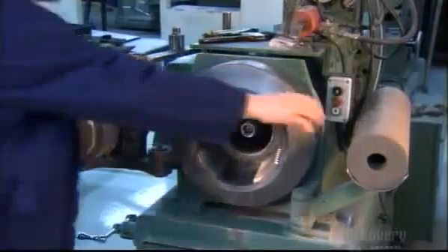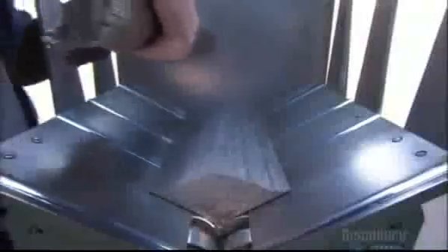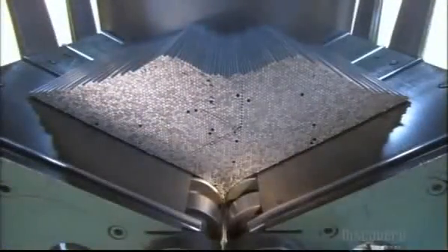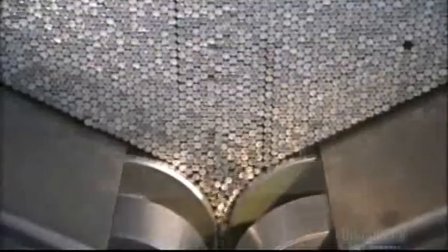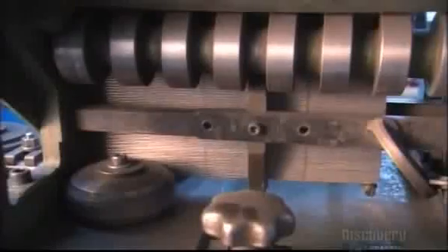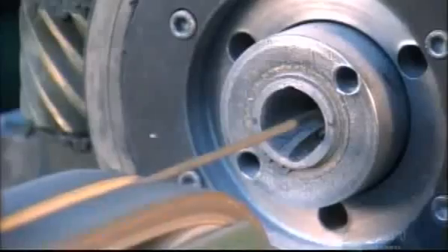Now to put the powder coating on the core wires. A worker loads four slugs into an extrusion press. It'll apply 120 tons of pressure on the slugs to shoot the powder through nozzles that'll coat the wires as they pass through the slug's hole. To load the wires into the press, they first stack them in a feeder. The opening at the bottom is adjustable for different diameters, because core wires range from spaghetti thin to pencil thick. These rollers pass them through the press one at a time, and four wheels then pull the wires from the feeder into the extrusion press for coating at a rate of up to a thousand electrodes a minute.